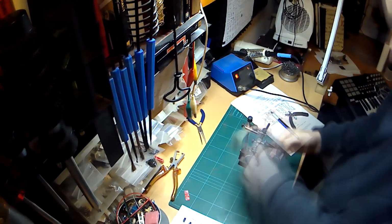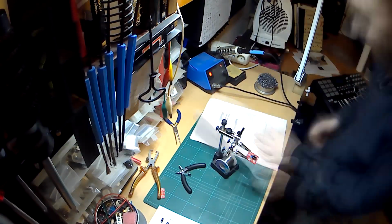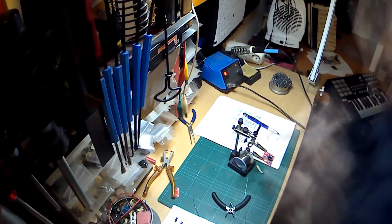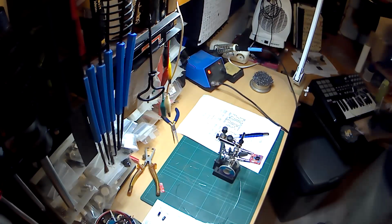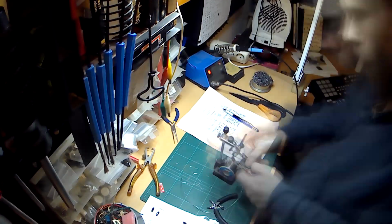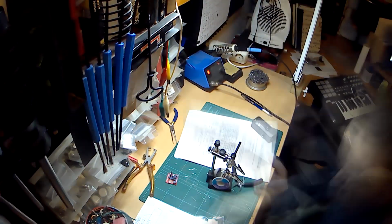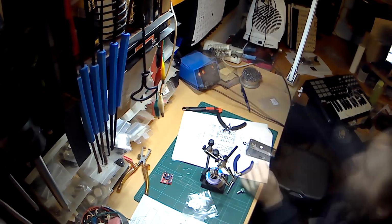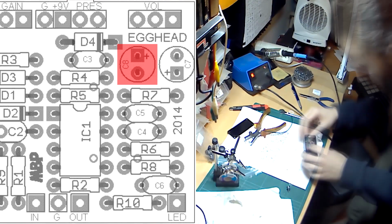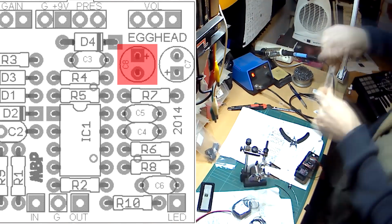Now the small board does not take a ton of components, and although I believe Madbean's statement in the documentation that it only takes a few minutes to build is a bit of an exaggeration, it's not a complicated board. The complications, however, come in when you start considering the small enclosure, as is often the case. Drilling has to be quite precise, and you should definitely look for small profile components, especially when it comes to electrolytics. As I mentioned before, the electrolytic at C8 turned out to be a problem for me. Although I do want to specify that that was my fault in the component selection, rather than Madbean's. But you know, it is something to look out for.